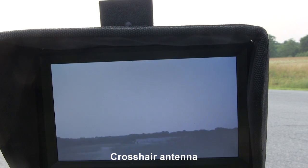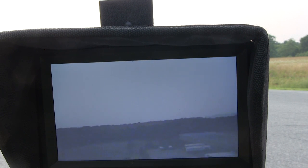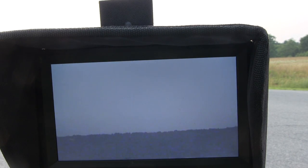Now we're on to the crosshair antenna. I'm speeding this footage up as this is a much longer flight than with the air blade or the helical. The video is a little bit more stable than it was with the helical, but I'm still getting a little bit of interference at the quarter mile point — I still don't know why. As I approach the trees I need to climb. I'm using a Pico CMOS camera so the video quality isn't great, especially not at this time of day. But the video is still holding despite going over those tree lines. Right now I'm at about the half mile point — video's still holding solid, plenty enough to race, though it's starting to break up here and there as I make my way towards the roadway.